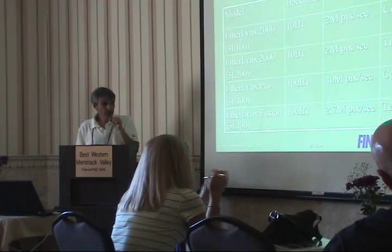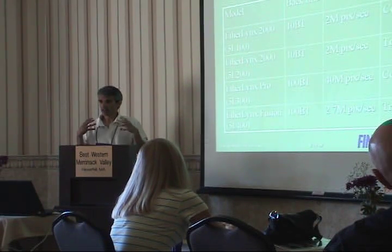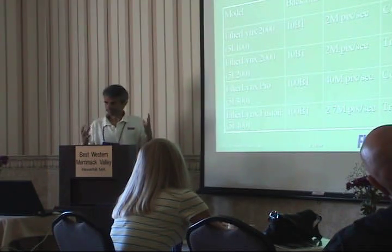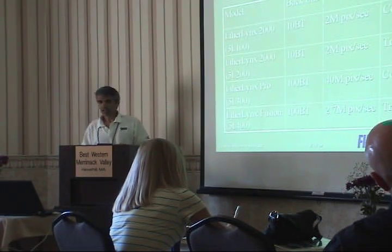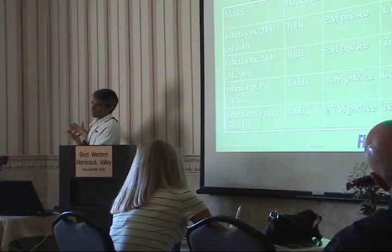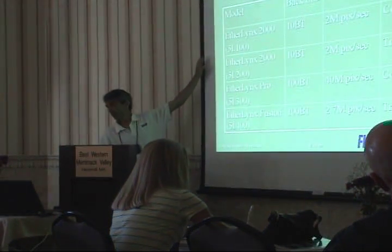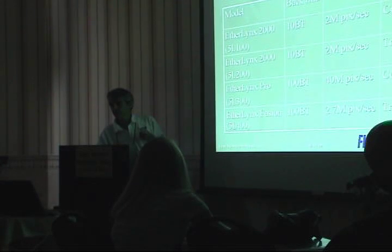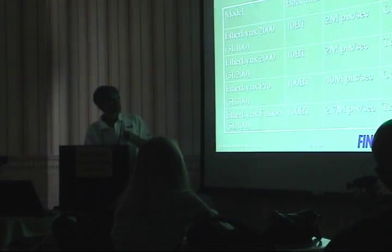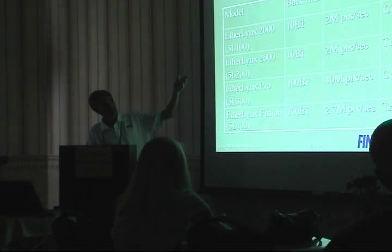There are other differences between these cameras than shown in this table, but the differences here allow you to quickly understand what separates these different camera lines. The best way to think about it is that data needs to come in the front end, get processed, and pass out the back end. The older cameras had 10-base-T back ends - just an original ethernet specification. The newer models have 100-base-T back ends. The more interesting thing from a resolution perspective is the front end.